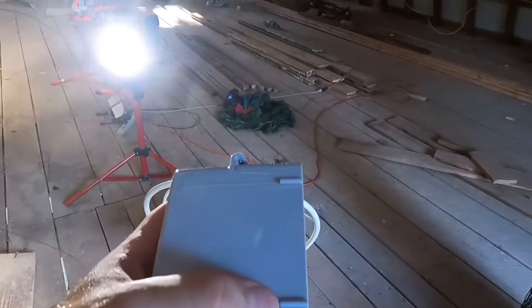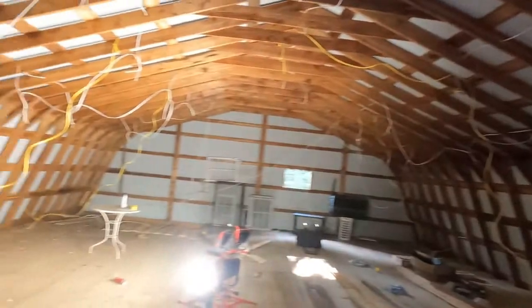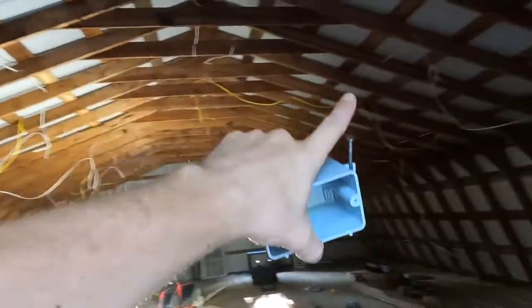So your typical box, okay? Your typical box, you got these little grooves that have a half inch offset. So this right here is what you're supposed to do, okay? See how those notches are sitting right up against it? I'm gonna be doing either beadboard, tongue and groove, or something like that all the way around and on the edges. So that being the case, they are 3/4.